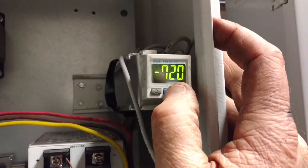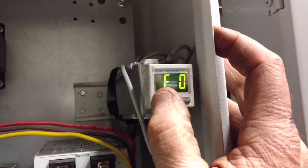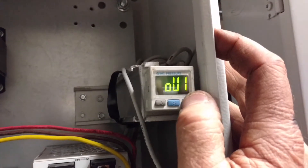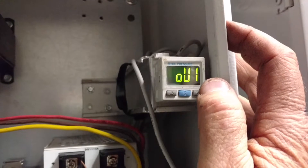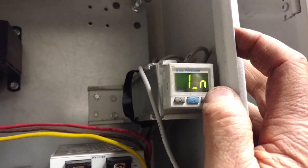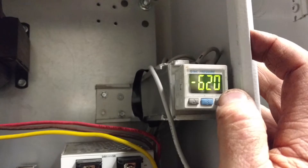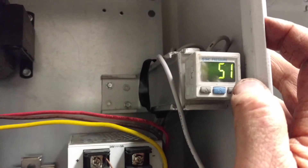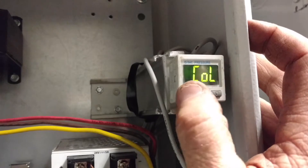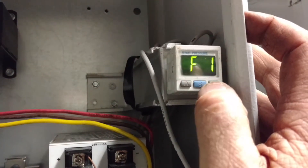If you want to go to setting mode on this, you press the center button and hold it. F0 is the first function. I think we want F1. So... hysteresis. Alright, we want to choose hysteresis. Negative. We choose the next setting — N1, minus 620. Hysteresis I got at 50. And then you can do the color. I got SOR — I guess that means when it's operating it turns red. That's good enough. We're done with F1.